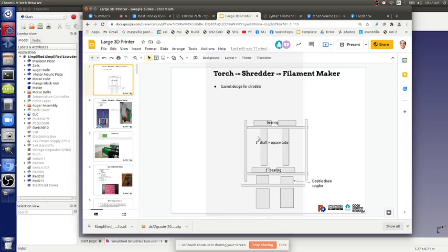The extruder is easy. The winder is going to be the most challenging, but it's nothing particularly challenging. What we have there is the small on and off switch logic, which is all done. So if we just replicate that, nothing too difficult about that. It's just two little limit switches with a long lever on them, and we have that part already there, so we can reuse that. And you're just turning on little motors to do the winder. The only thing to be specific about is that we can use what already exists there, driving the actual spool, but we have to make the structure more solid. You saw the rubber band to tension it, and it'll make that a little better. But none of this is particularly hard.